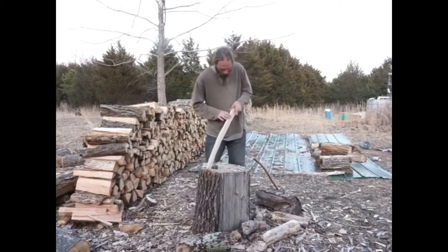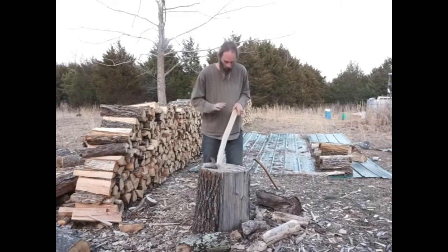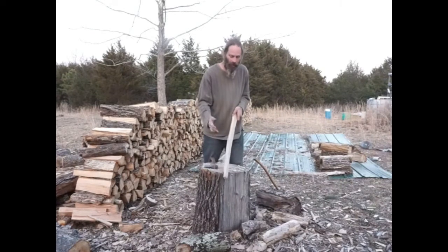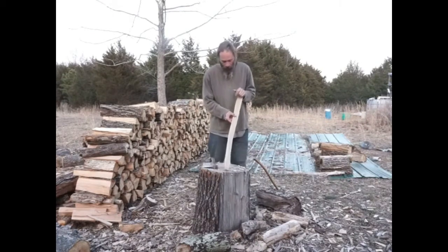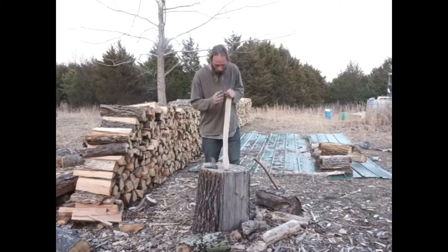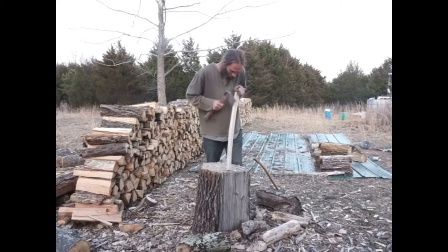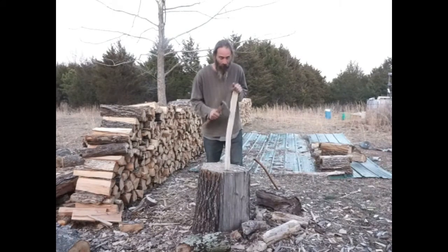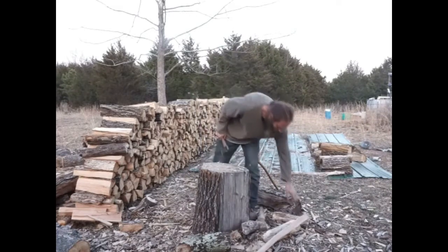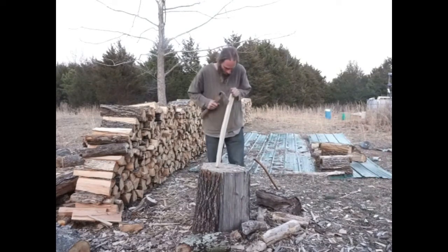You see how when you cut those little spikes in there and chip it off, you're using the run out of the wood too, because it's going to tend to flake off instead of tearing out and gouging into the wood, which we definitely don't want. So this is kind of a steep angle going in, so I'm just taking my time, doing it slow. Even though it's a steep angle, I don't really want to do too much on it. I'd rather remove the material down here first and then bring my angle down to meet it than go the other way around and end up tearing out too much and catching this somewhere down here and ripping the bottom of the handle in half. That wouldn't be any good.